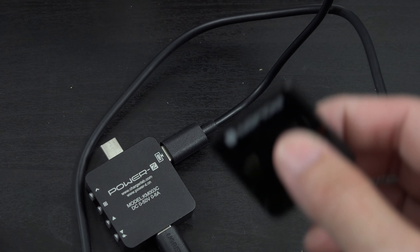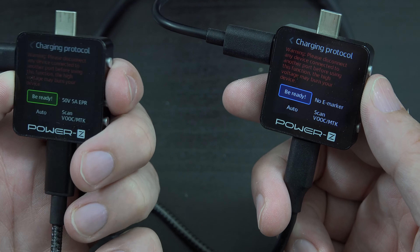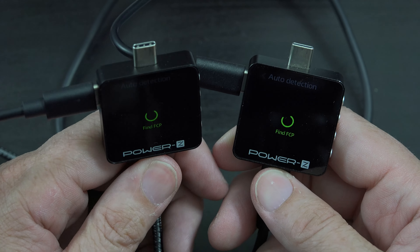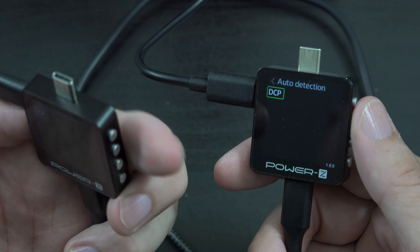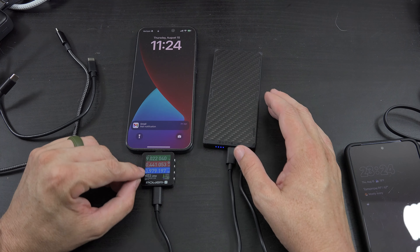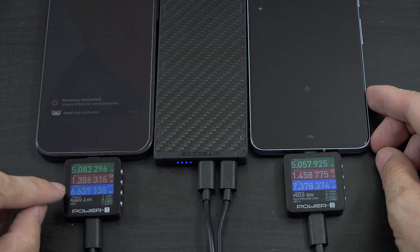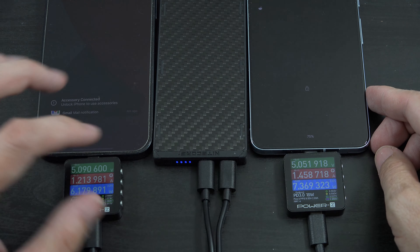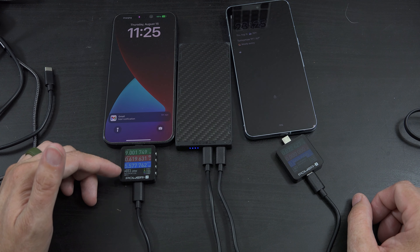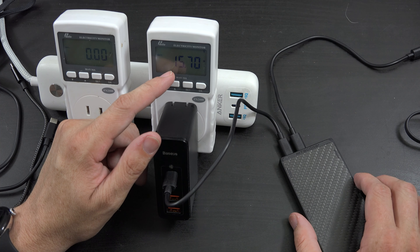One of the newer things I've been doing is plugging in a second tester. Tester on the right is connected to C1, tester on the left to C2. Running them both at the same time — it's not going to split the power evenly at 10 watts per port. And right, we're not going to have power delivery on both ports simultaneously. With just the iPhone on the left port, we're capable of up to 20 watts. Adding a second device changes things — we're getting almost 7 watts to the iPhone and right at 7 watts to the Pixel, about 14 watts total. The moment you remove one device, it renegotiates and jumps back up to 20 watts. You're only going to recharge this thing at about 18 watts, so it's not the fastest at recharging itself, but it's not bad.